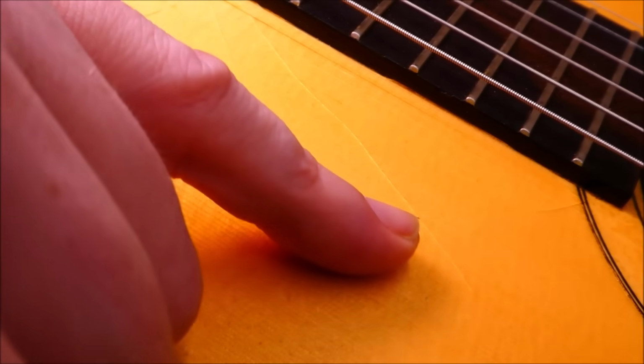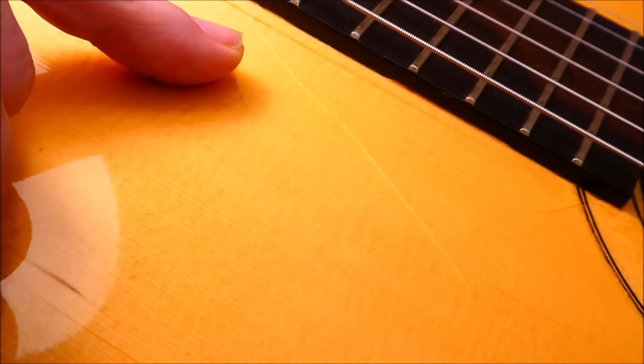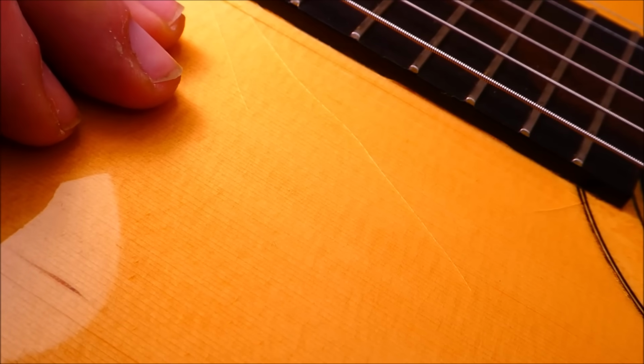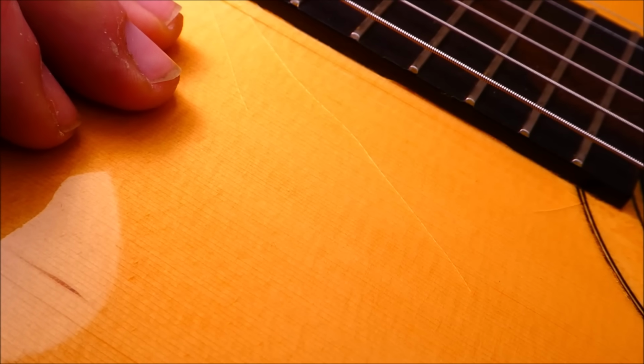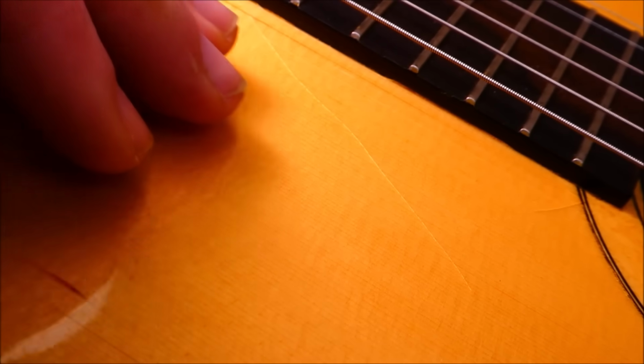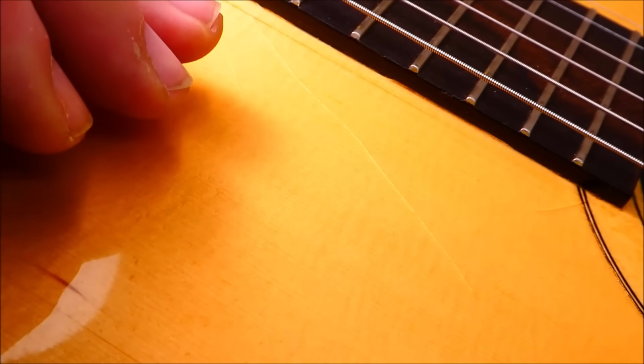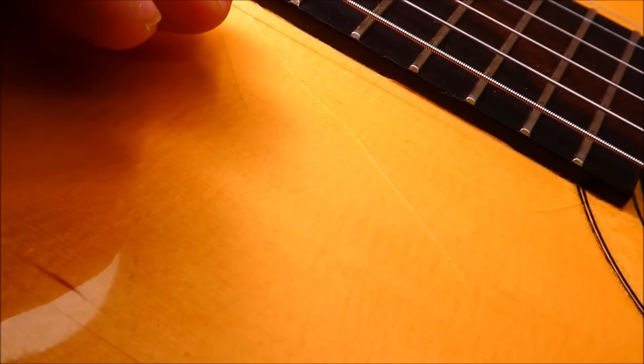This guitar has some checking in the finish. This is nitrocellulose lacquer, and I've mentioned it before. There are a few different kinds of checking that can occur in lacquer. There's the type that happens from age as the finished film dries out. I'm tempted to equate it with what's known as craquelure in the art restoration world. I'm giving you guys all the French words today. That's a tight, square kind of check that looks like a Kalahari mud hole in dry season. You know, mud cracks, basically.